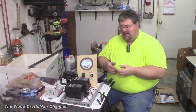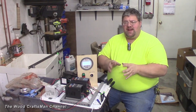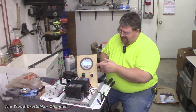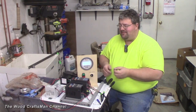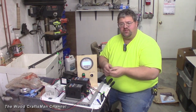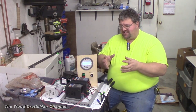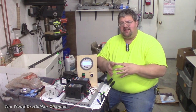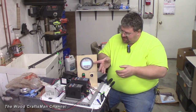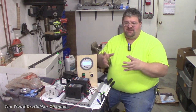The air makeup blower I wanted three-phase because I want to maintain a specific static pressure within this room or building. What's going to help me do that is the Dwyer Digihelic DH3 digital manometer. It's actually a communication device — it sends out a 4 to 20 milliamp signal to the VFD, which automatically adjusts the frequency to the motor to maintain that specific static pressure.